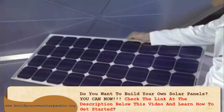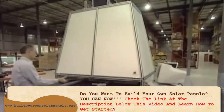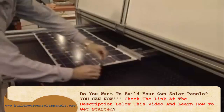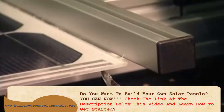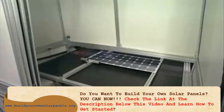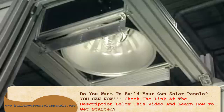Here's the finished panel. All the components are bonded together. They now proceed with a test. The panel is placed in a solar simulator, and the negative and positive contacts are connected to a voltmeter. The panel is inserted into the simulator and a powerful lamp illuminates it. The voltmeter is read to make sure that the panel supplies the required electric current.